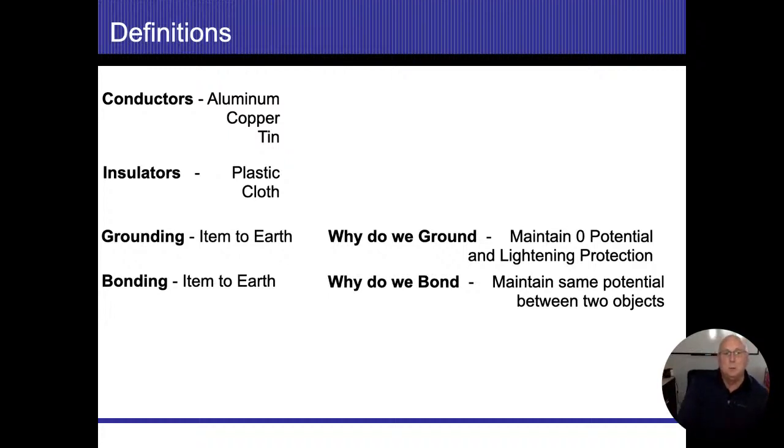Aluminum in residential wiring was used around the mid-60s to the mid-70s. If you don't know that already, you are going to want to write that down. So again, it's the mid-60s to the mid-70s. It's going to have plastic insulation, and single-strand wiring really isn't allowed anymore.